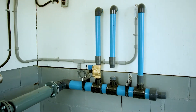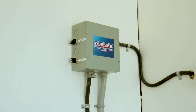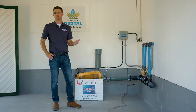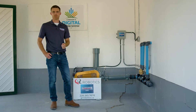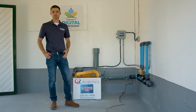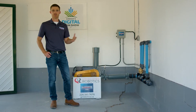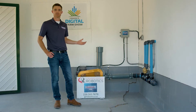Normally we have a control panel here — that'll be here in about a week's time. We're only running this system about three cycles a day on dairy manure, so that can range anywhere from this tank we have here, which equates to about 20 minutes of daily runtime. Depending on the size of your tank, that could go up to two-hour cycle times or six hours a day. But very minimal hydro costs and very minimal energy consumption out of these tanks.